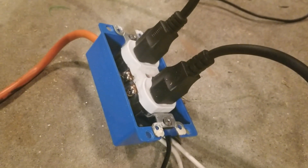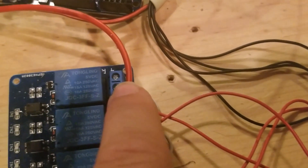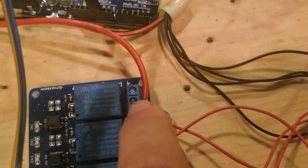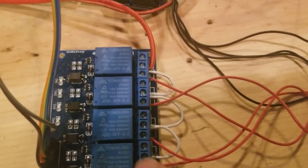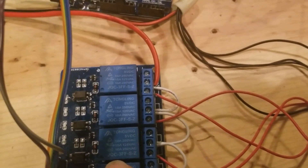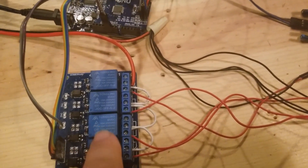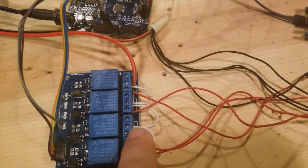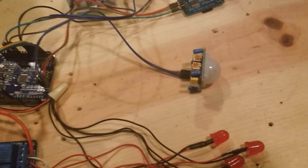I've got a separate power supply going to the AC because that's 120 volts. I've got 12 volts going to the UNO, and another 12-volt power supply going into the common terminal on relay one, which is then piggybacked into the common terminal going on down — so all these relays have power. It's up to the UNO program to open or close them, completing the circuit to turn things on or off however they're programmed.